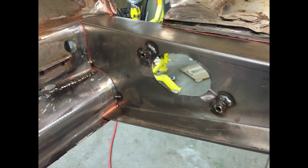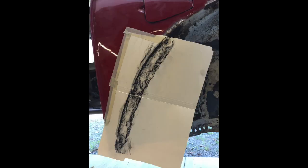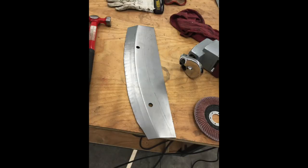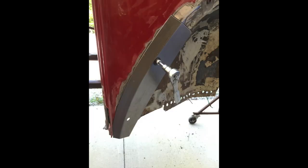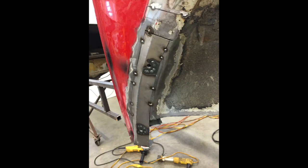This piece turned out pretty well. The heater channels were the toughest bit — it got a little intricate where a bunch of corners come together. I hit on this technique of using a crayon to take a rubbing of an area, and even the bolt holes came through in the rubbing. Transfer that to metal. I used a bead roller to do that curved bend there and then just bolted it in place before cutting out the old bit. Use it as a template to trim, then tack the new piece in place and move on to the next thing.